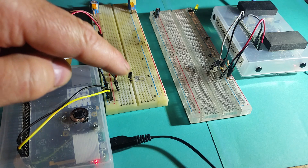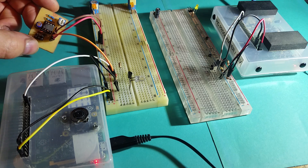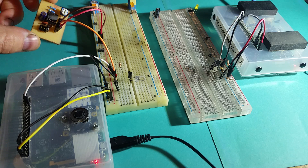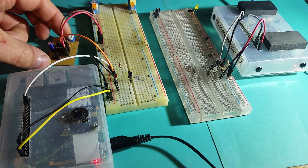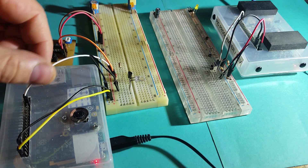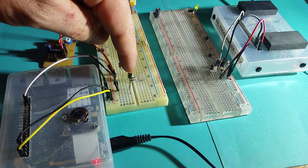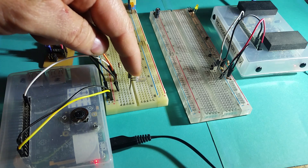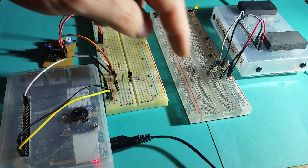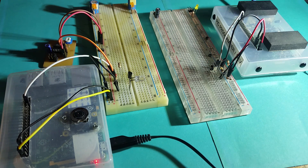In order to transmit 38 kilohertz from this LED, I've got a circuit which is just a simple 555 timer, adjusted to be set at 38 kilohertz. That runs all the time at 38 kilohertz. I've got a transistor in the circuit board, and the Raspberry Pi pin switches this transistor on or off. When the transistor is switched on, it allows 38 kilohertz to get to the LED and transmits the 38 kilohertz required for the receiver to detect a level change.